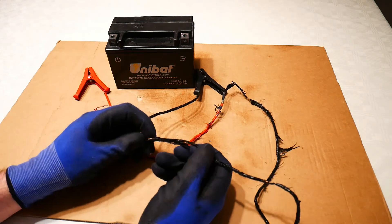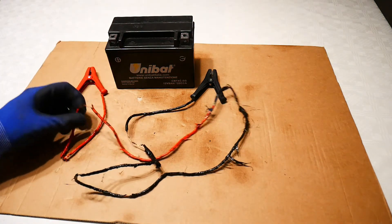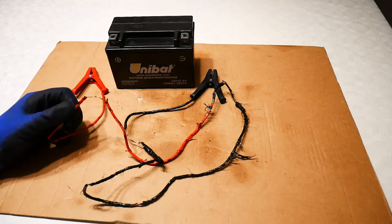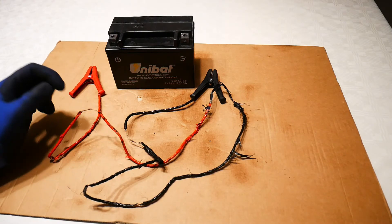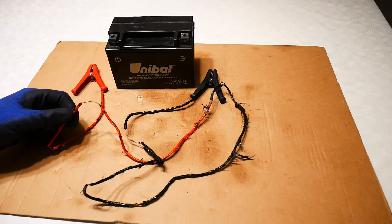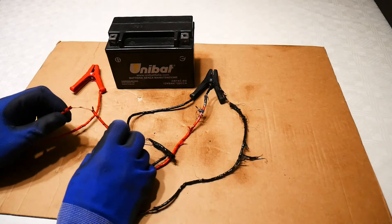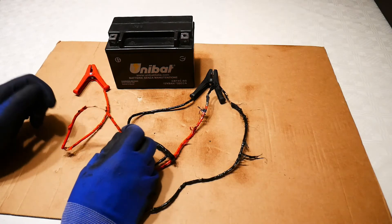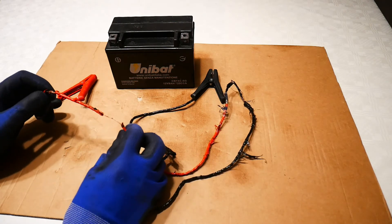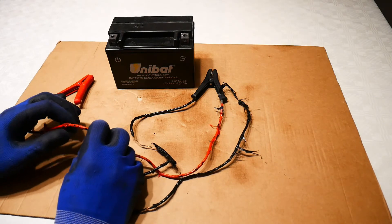The electrical wire, which is made from copper, is still perfectly intact. The reason is that the insulator is only rated for temperatures up to between 75 and 100 degrees Celsius, whereas copper as a metal remains solid up to above 1000 degrees Celsius — above that temperature copper will melt. So before the copper wire heats up to 1000 degrees and melts, the insulator will be long gone. By the time the copper could melt, all the insulator will have basically burnt or disappeared, leaving bare wire.